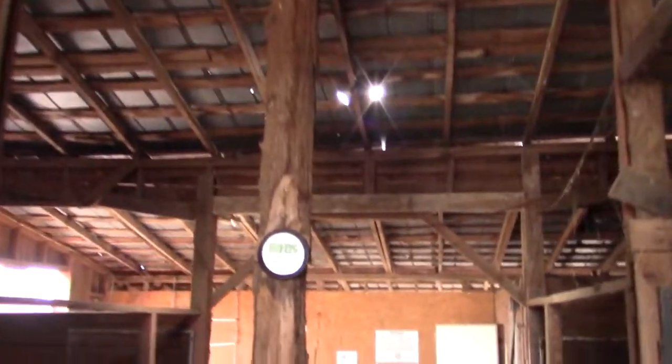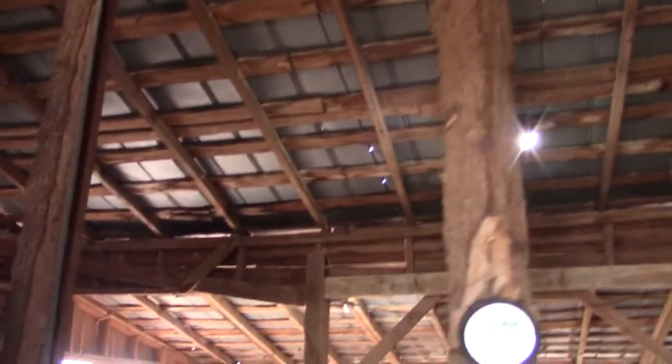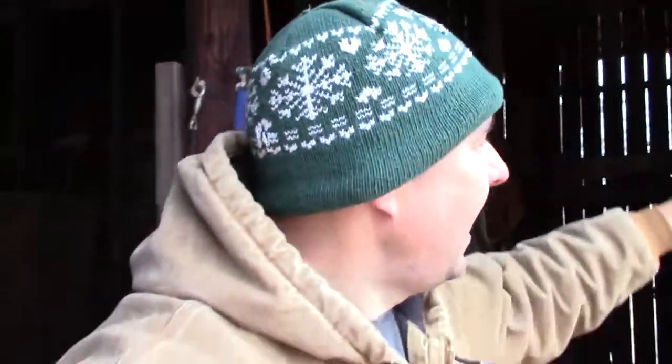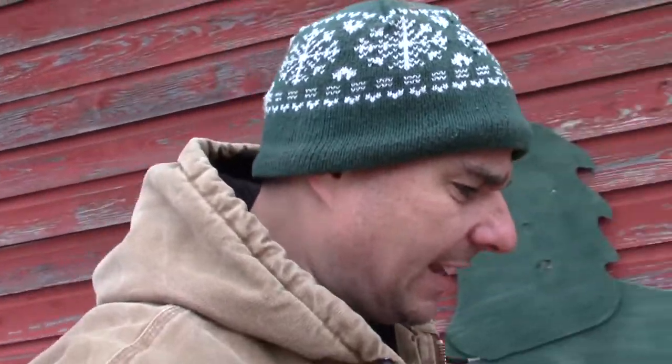had fluorescent lights in here, and you can see there are a few holes in this barn. It's an old barn, and what was happening was water was finding its way onto those fluorescent lights, and the fluorescent lights were arcing. Not good. So we've replaced the lights in here with floodlights that are sealed. So no matter what, they are safe, and they're up high and not where leaks were anyway. But even if they were, they're sealed with gaskets and stuff like that.